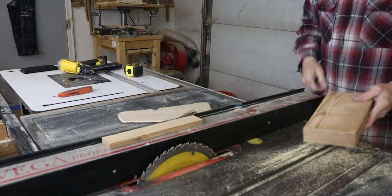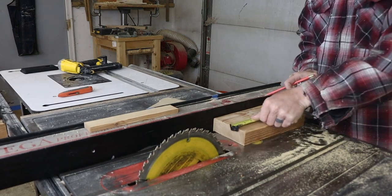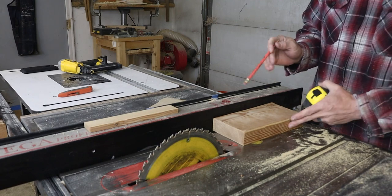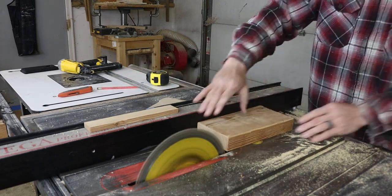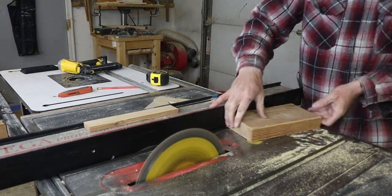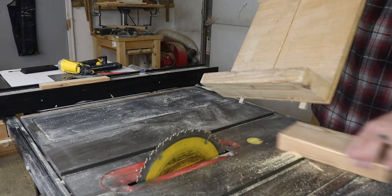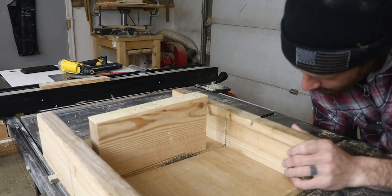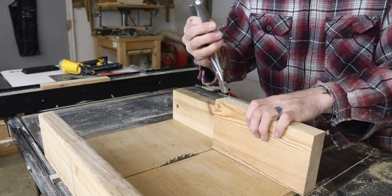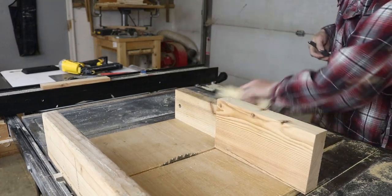I'm going to bring it all the way up. We're going to need to cut this right around to the eight inch mark — it doesn't have to be exact, feel free to eyeball it, because the length of your shim is going to be determined by where your table saw fence is set. An inch should be right about there. You want your table saw blade to come right up to that corner right there, so the shim can come off. Now we can go to our mark.